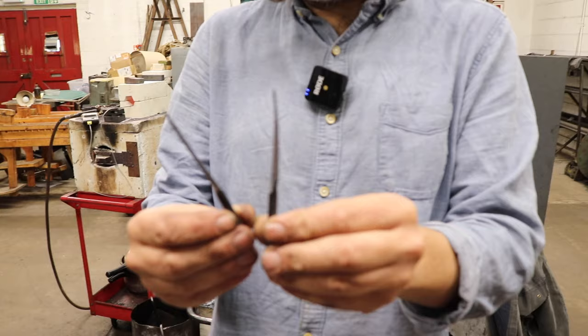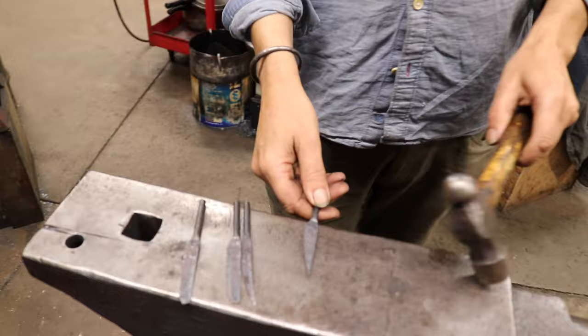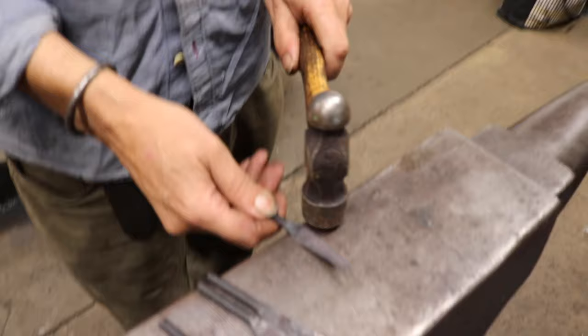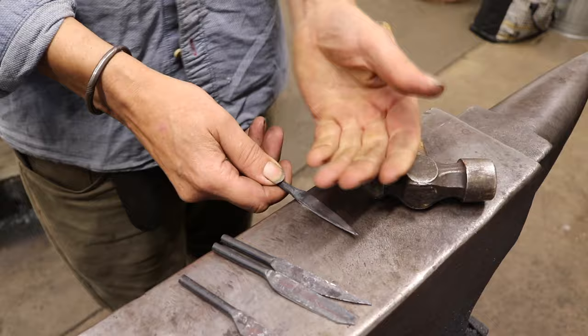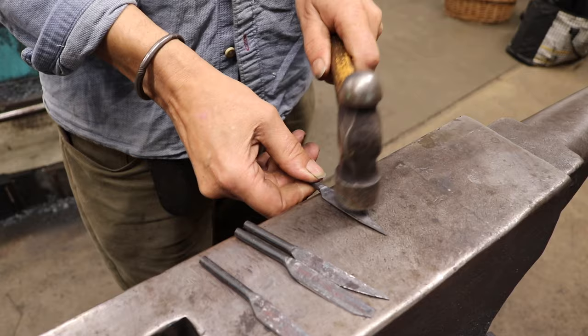These are cold, they're soft, so you can actually do it. I find it easier to use a light hammer moving quickly for this. And the general idea of straightening is, if you've got a bend, you don't try and hit the bent bit which is pointing up, because you just get a rocking action. I always talk about putting the hump up on the anvil and flattening down to it. So I wouldn't be going this way, I'd be going that way.